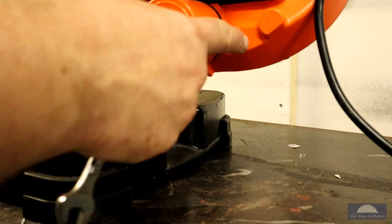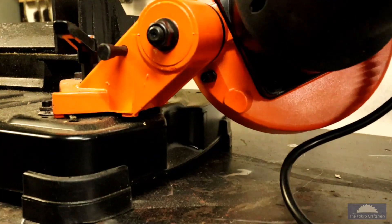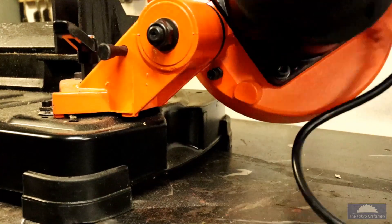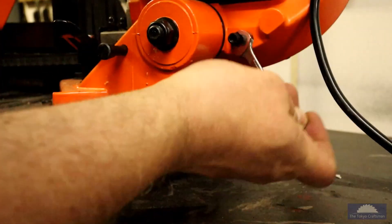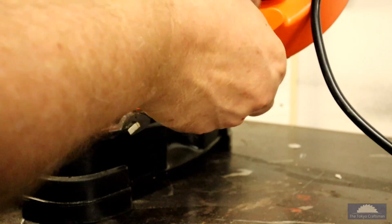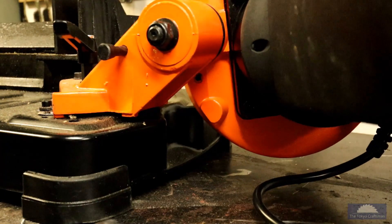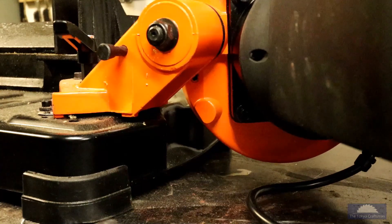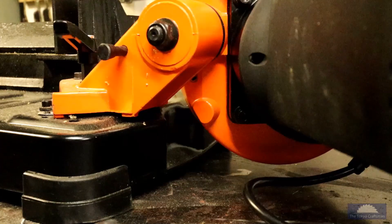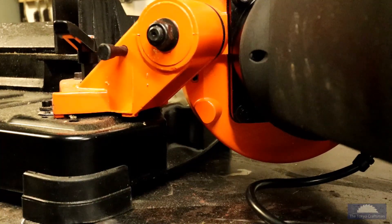As you can see, this screw on the back — or a pin, a bolt — when you roll this back it contacts the case here and doesn't let it go any further back, but it doesn't let it go anywhere near 90. I've got my 10 millimeter wrench, I'll just loosen that off and take it out. Now it'll go back to 90. I can go back as far as I want. I guess it doesn't tip over so maybe it'll be okay. Once I put the heavy plate on the front to make the table, it should be fine.